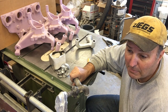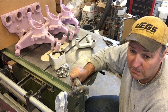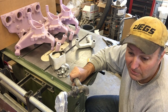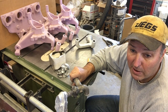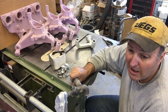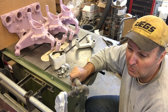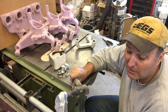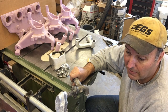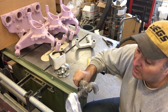That's about half the time of the non-vacuum assisted pour, so the metal front was advancing through the foam at twice the speed — having to evaporate the foam and get rid of that gas at twice the rate. I suspect that even with the vacuum it couldn't handle that, and that was probably the cause of the big flashback. I was thinking the vacuum would just pull the byproducts right off the part with no flash, but that's not what happened at all.